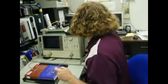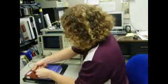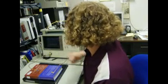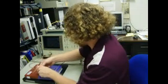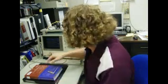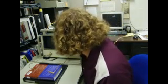Next, I need to do a load, connecting to port 1 first. Once you hit load, it changes — this is a broadband load. Then push the button, done loads, and you have to do the same thing for port 2. So I push S22 loads, and now I press broadband, and done loads.